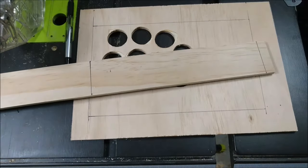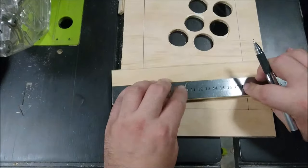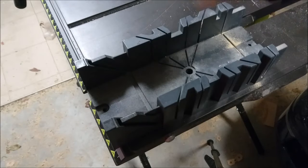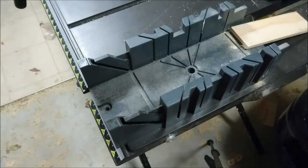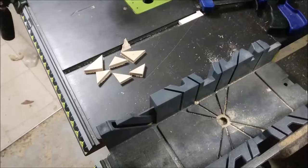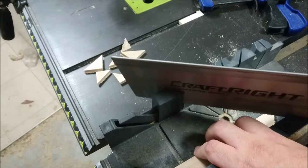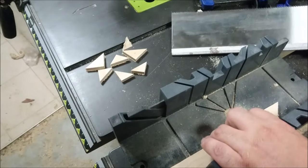The two long wall lines. The two short walls, however, are going to be as long as the shorter drawn lines plus an additional 14mm as they'll overlap the long sides. If you want to get nice square cuts with a hand saw, it's pretty hard to beat a mitre box — they're cheap and make perfectly square cuts a complete doddle. Now I've used this mitre box to cut several of these little gussets by alternating straight cuts and 45 degree cuts. I need one small triangle for each corner, and I'm doing up a couple of bigger triangles by making two 45 degree cuts to sit in the middle of each of the longer walls. This will cure the slight warp in my ply sheet, making the walls nice and straight.